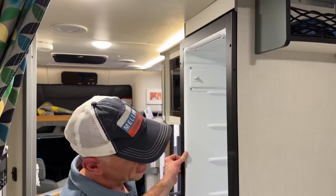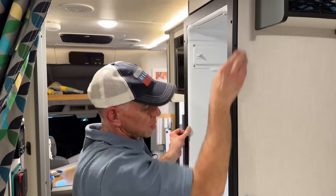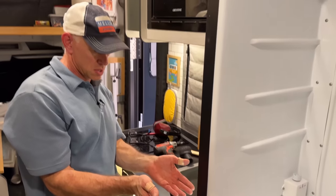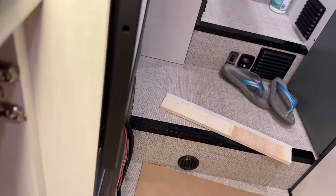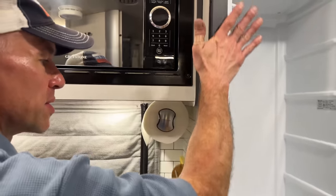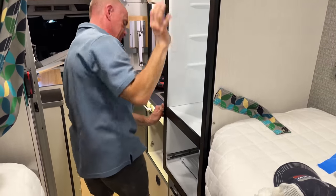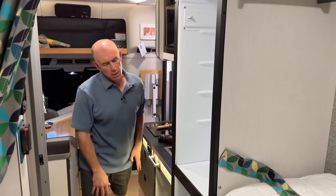We're in here, and the wall is not nearly bowed. Maybe a tiny, tiny bit bowed out a little, but we're in. That's what it should look like. However, over here, we've got a quarter inch gap. So all I can conclude from that is that the fridge opening is not square. An eighth of an inch gap now instead of a quarter.